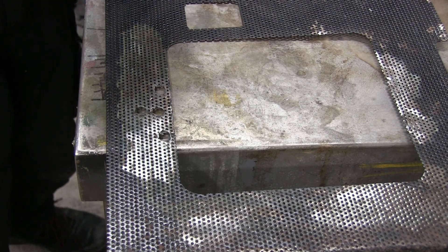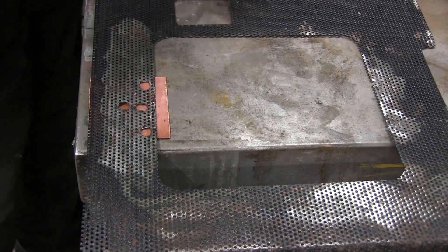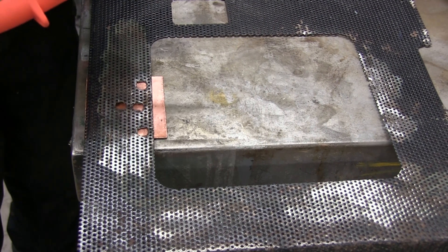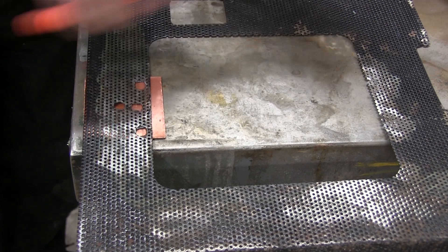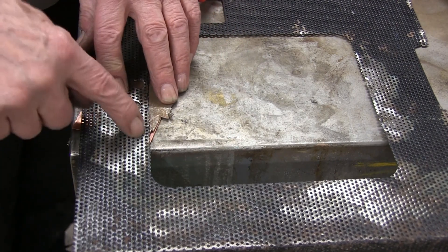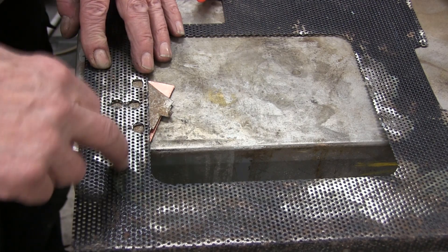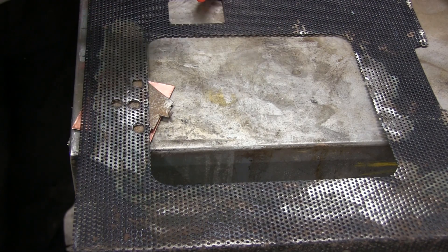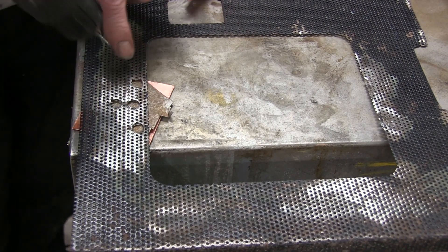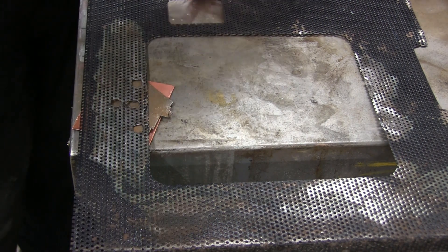What I've got is a piece of copper pipe cut in half and flattened out - that's going to go behind where those holes are. I've cleaned the metal up both sides. I've got some metal of the same gauge, and I'm going to cut little circles exactly the same shape, mark them so they fit exactly in there. I intend to make them flush then grind them off, mark the lines where the holes go, and use exactly the right size drill bit to drill out the holes. Hopefully when you paint it you won't see them.